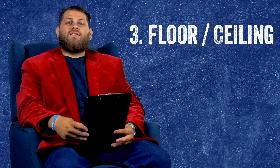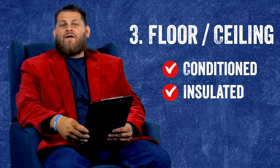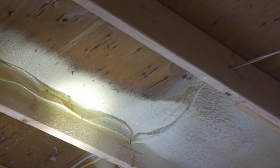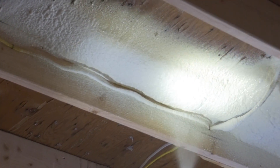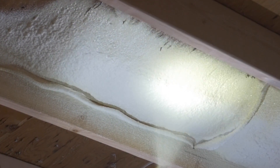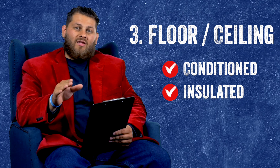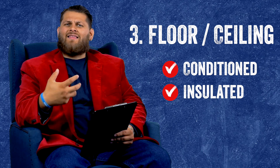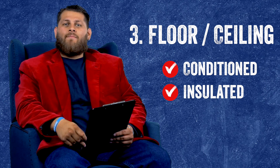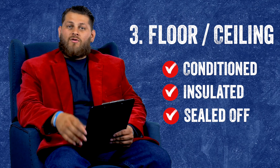So make sure it's conditioned. We've talked about how important it is to make sure the area is conditioned and to insulate the space, but I really want to drive home the point of how important it is to insulate the floor of that bonus room — or the ceiling of the garage. That room may not cover the entire ceiling of the garage; it may only be a portion of it. Whatever the case, it's crucial to make sure the floor of that room is properly insulated. Garages are typically not conditioned at all, so any cold or heat inside that space will want to drive into that bonus room from underneath. You really need to properly insulate and seal that garage off from the bonus room above it.